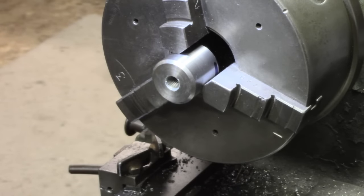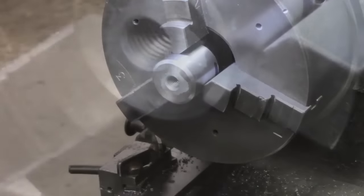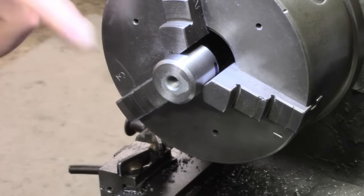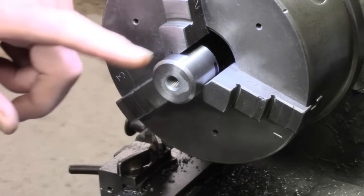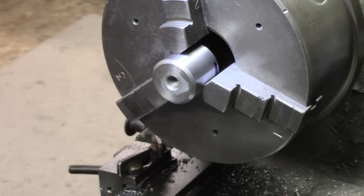And that basically will make the ball ready for putting on the fitting. I don't think it is set up absolutely dead true, but what I shall do is put everything in the 4-jaw and set up the ball blank to run true, even if the arbor runs fractionally out. So I'll try and get. I've got to grind some tool as well.